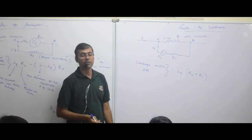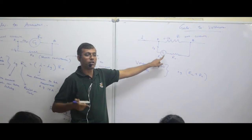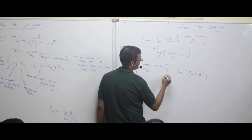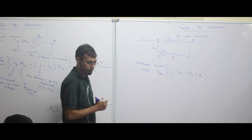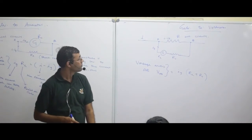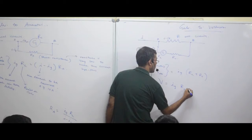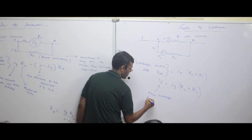Why series connection? Even though I am not showing the resistor here explicitly, the galvanometer has a coil, and the coil has a resistance — that value is what is called rg. So ig times rg plus rv, that is the voltage V_ab. The voltage V equals ig times rg plus rv. This is the maximum voltage you want to measure.